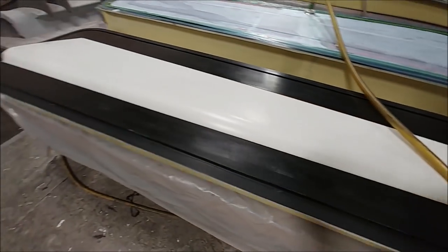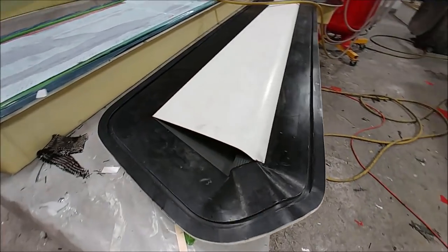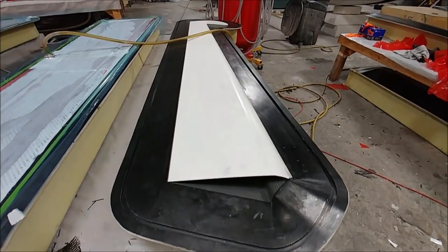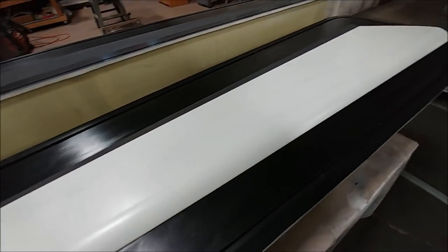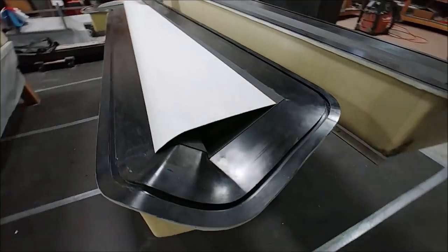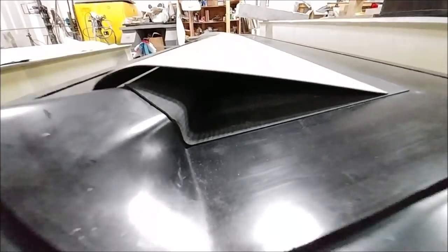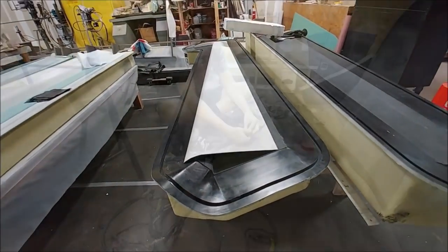What you're looking at here is two of the rudder skins together — the one that fits in the mold and its other side. If you look closely you can see how they mate together. They've been perfectly trimmed back to the cut lines, and the ribs will go in between those. Then a little fixture work for where the hinges are going to be, and they get bonded together.